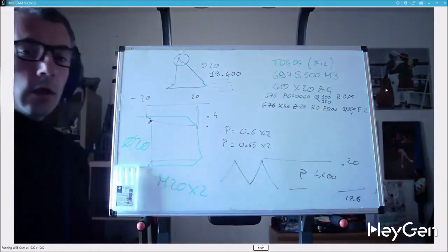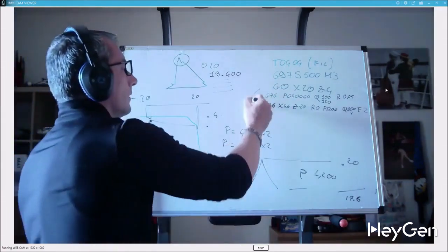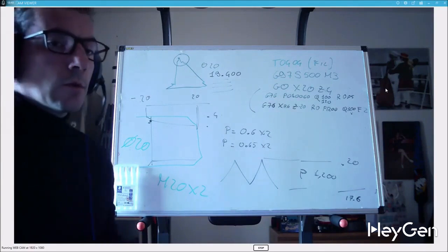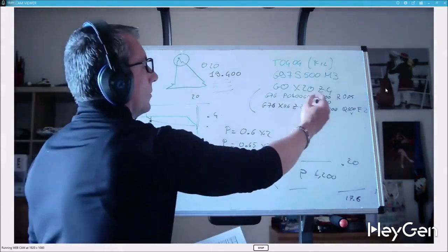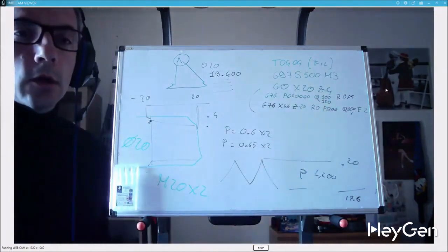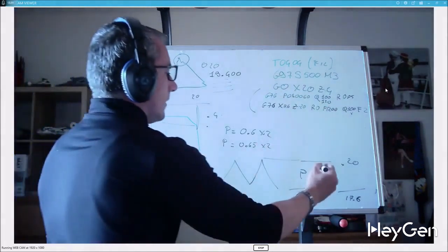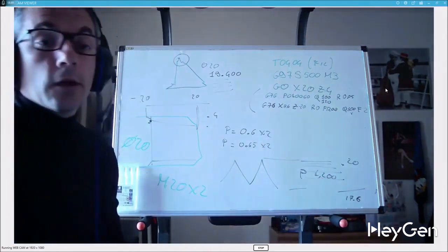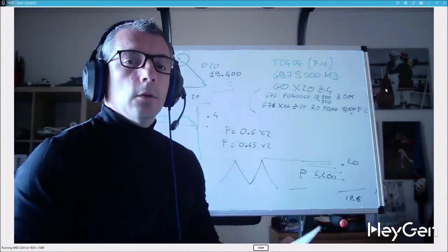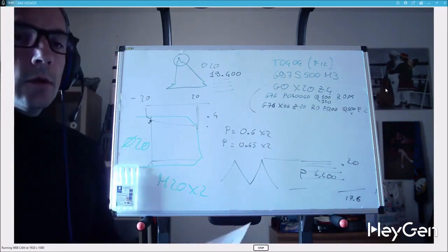However, for example, when you work on controls like CS, everything I explained is conceptually fine, but the macro is completely different. For instance, it doesn't give you Q like before as the final pass or initial pass, but it gives you the number of passes. So you divide the height of the thread by a certain number of passes. Everything is the same, at least on the very old CS systems I used to work on. So this macro is quite rigid. I explained it according to Fanuc.